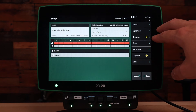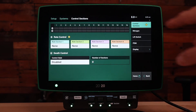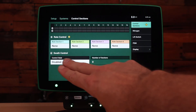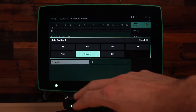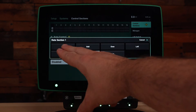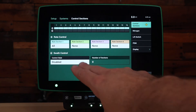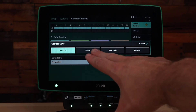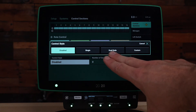The systems tab is located on the right. Under our systems tab we will need to set up the rate control rows as well as swath control style. In this case we're going to set up rate control across the whole planter with all rows in the same rate section. For swath control, depending upon your GPS level of accuracy, you may need to either select single for single row control, or dual ends which will merge the outer rows together.